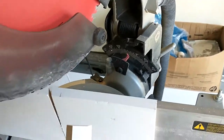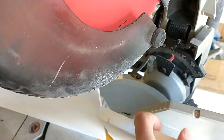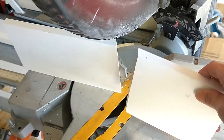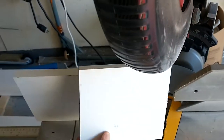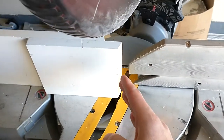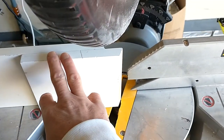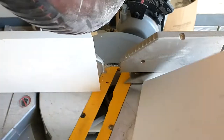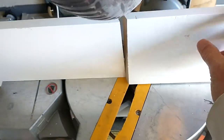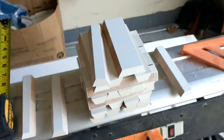You'll get your perfect little 5⅛ inch piece. Make that cut, get your off cut, rotate it back this way — you may need to overhang it a bit because the cut is going to be at a different angle. Make another cut; there'll be a little off piece that may kick out, not the end of the world. Just keep rotating back and forth: slap it this way, cut, rotate, cut, rotate, cut — and in a matter of minutes you can consistently knock out a whole bunch of little pieces. Works out really great, hope it helps.